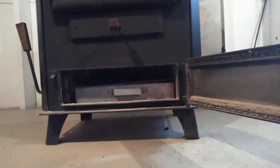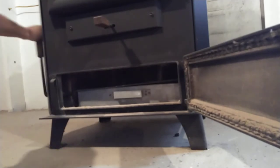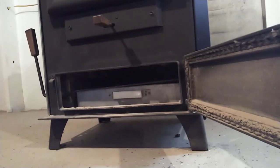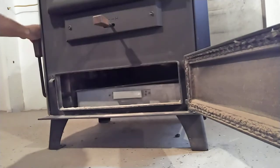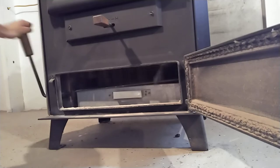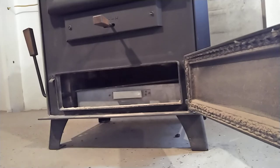When you open the door, more air is coming in and the flames get higher. I'll look in there as the ash is falling — it kind of defeats the purpose of having an external handle because now I have this open and dust can get into the air. But now I know I'm not over or under shaking it. I start to see some orange falling, so I'll stop.